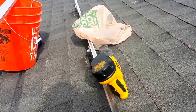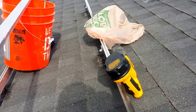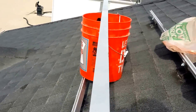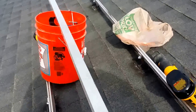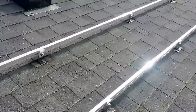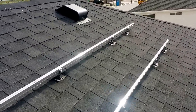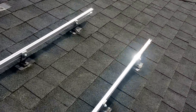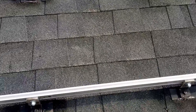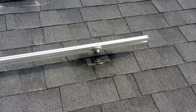You start with the rails, putting one of the L brackets into the trusses with a four-inch lag bolt every four feet. The rails I purchased come in eight-foot sections. On this top row I'm putting seven panels, and three panels below. Our trusses are 24 inches on center, so on the end I put it on the next truss 24 inches out so it wasn't hanging out too far.